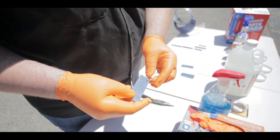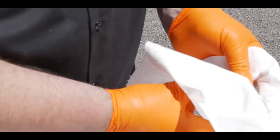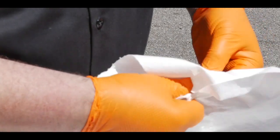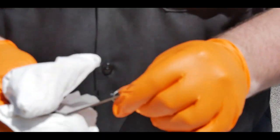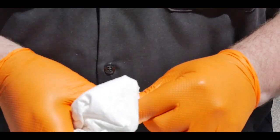The samples I prepared today are mirror polished. I wanted to show how the Damasteel looks when it's contrasting with the gray up against the mirror polish. However, Damasteel can be finished any way you want — you can do a satin finish, you can do a bead blast, it's still going to etch, but the contrast seems to be more pleasing to my eye with a mirror polish. These samples are mirror polished on one side and we're going to go through the initial prep of cleaning them. They're already on wires, so I'm going to use Windex to degrease them. Damasteel can't have any finger oils whatsoever when you're going into the etch — it's going to act as a resist and keep the acid from touching the steel. So with rubber gloves on, we're going to go through with a really good rag and Windex and clean these samples one by one, making sure everything's degreased.